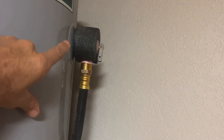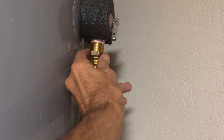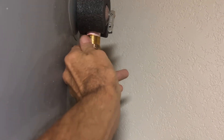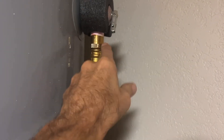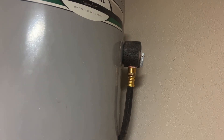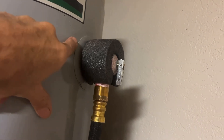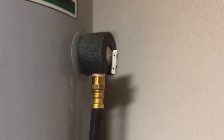Then you can safely remove this. Get yourself a pipe wrench — it's the best one to use. Unscrew the bottom here, that will hang loose, and then you unscrew the top part here, because that's one solid piece. Now you're ready to take off your piece up in here. Make sure to use your Teflon tape on the new one. Clean off the threads on the inside of the tank itself — get some acetone or a rag and just clean it up a little bit. Wouldn't hurt. Then put it back in, and now you have a fully functioning pressure relief valve.